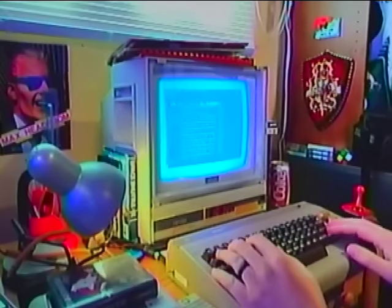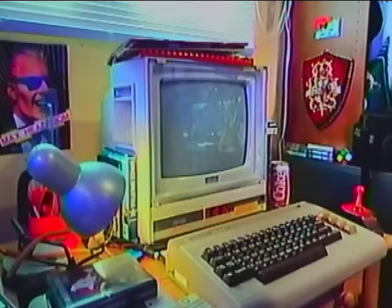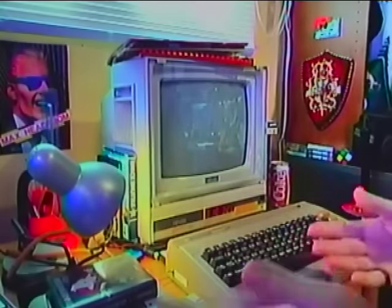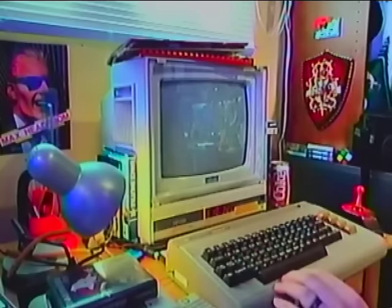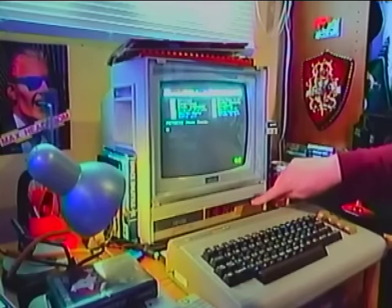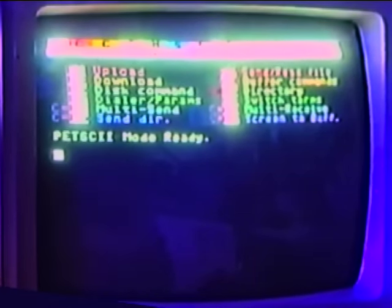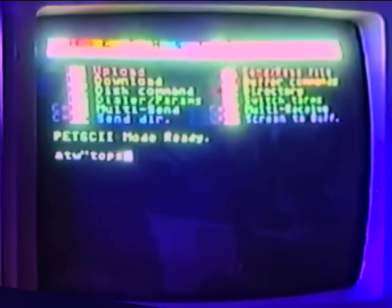I think we're done loading — let's run it. We had a nice little ping there. The first thing we're going to want to do with our modem plugged in is configure it to work with our Wi-Fi router. To do that we type ATW and then in quotes the name of the router — this isn't actually mine — and then the password, and then hit Return.